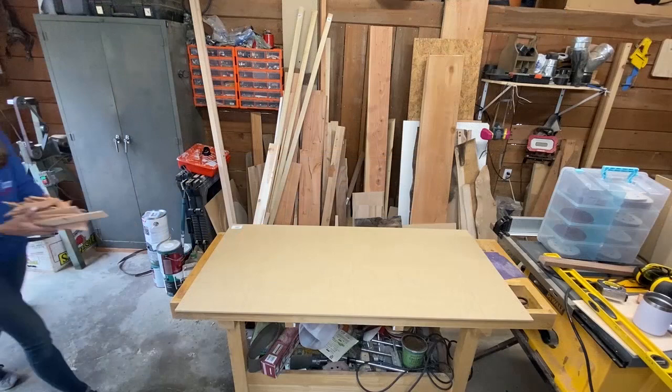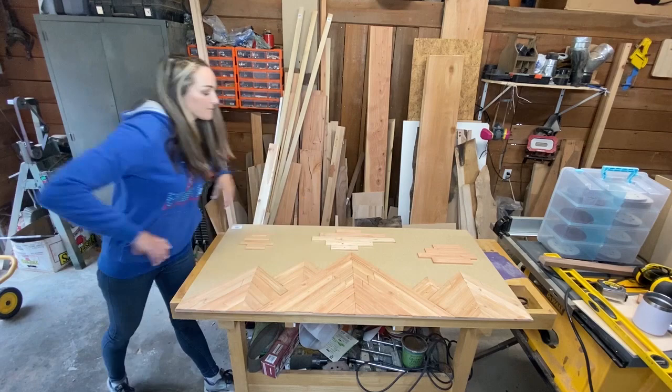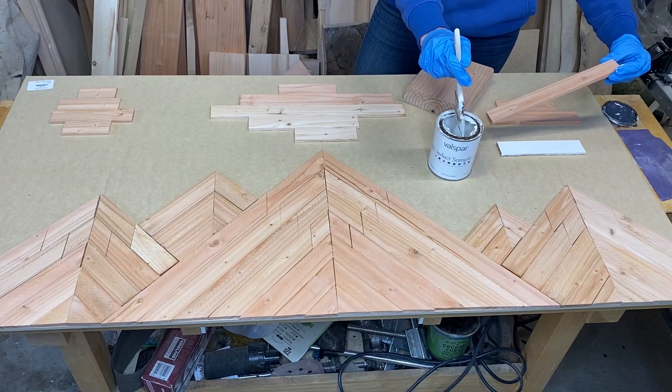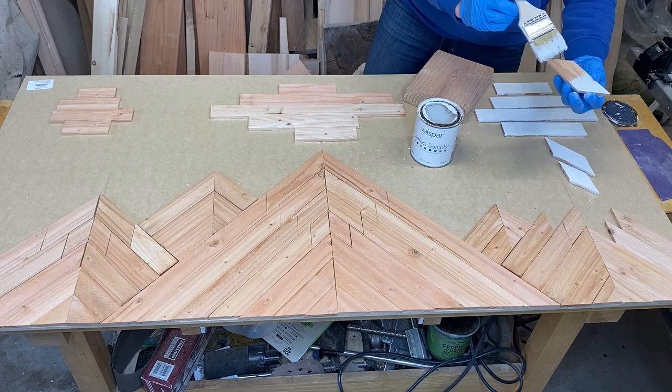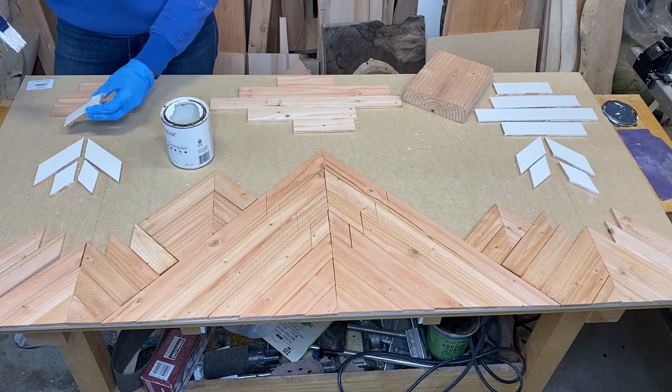One thing that has helped me the most is when making my pattern, I leave a small gap near the edge on all four sides. This allows me to make my whole pattern and have four perfect sides that are factory cut since I use a project panel that's already been pre-cut for me. Now, to hide this small gap around all four sides, I just use a trim piece in the end. This also helps so that I don't have to be so precise and make sure that it lines up exactly with the edge.